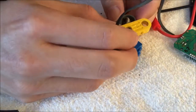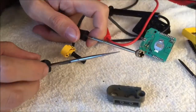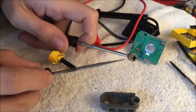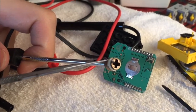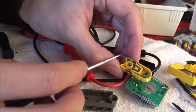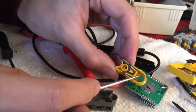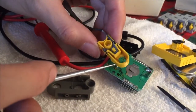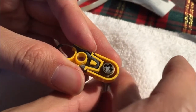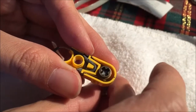With the sensor side open, you can see how it works. The metal drum has a plastic ring with some bumps on it. The bumps lift the metal prongs off of the drum as it rotates, and this breaks the sensing circuit. The computer simply counts the frequency of the breaks in this non-directional mechanism to get the rotational speed.